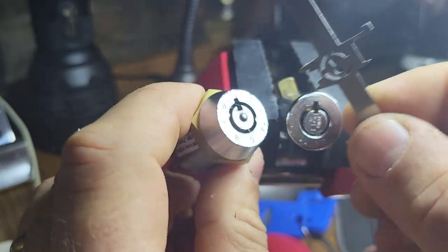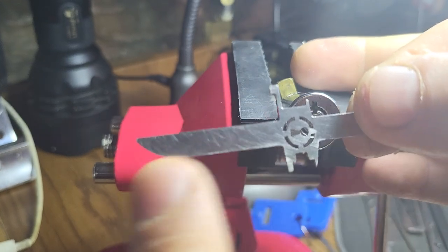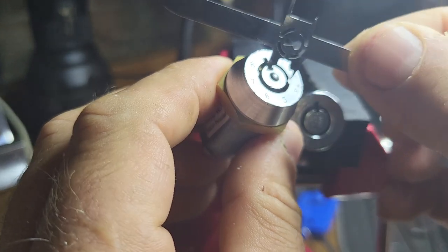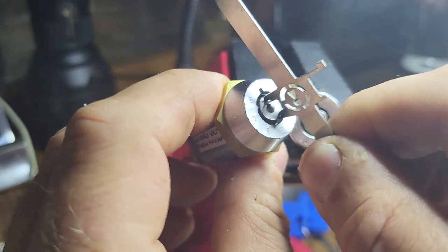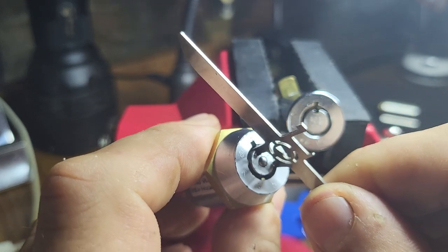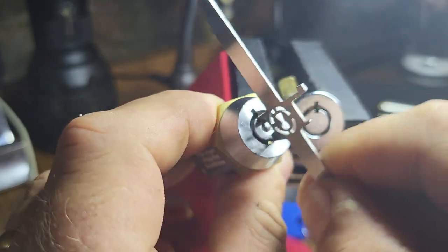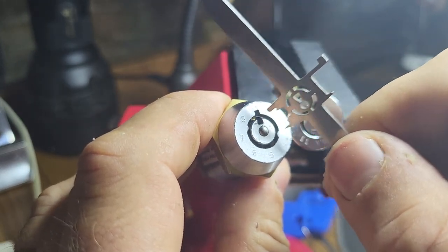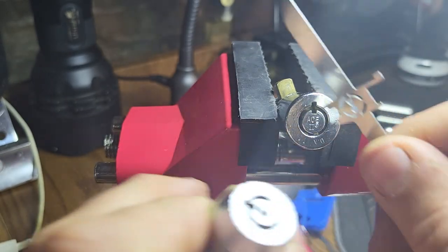But there's another problem. This gap here in the centre, between that wider lug and the pointy bit there which has been filed down — that lug goes into the groove in the top of the lock, and the other side jams against the body of that central pin. Except not on all locks, and it doesn't on this one. So it will literally swing from side to side, not catching or tensioning the lock. So it's no good for this kind of lock. It fits this Ace 2 here, this American one — that fits absolutely fine.